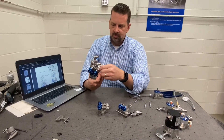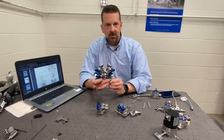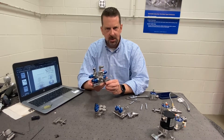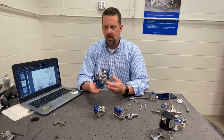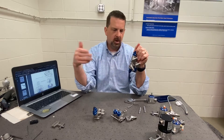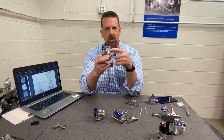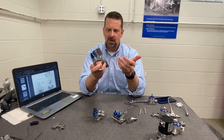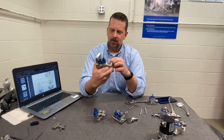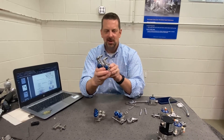The switch block can be ordered with or without the solvent purge, and with or without each of the dump valves. Just a couple weeks ago in the lab, we saw an application where someone was using this in a multi-gun setup where there was a single fluid line coming in, and they actually used this block to feed multiple guns. It wasn't really intended for that, but it worked out great — just one of the infinite flexible possibilities with this product.